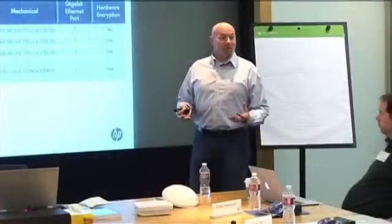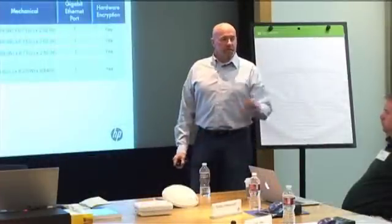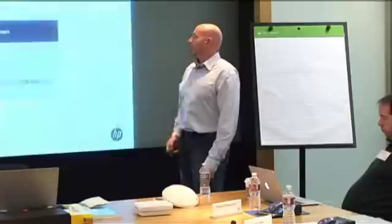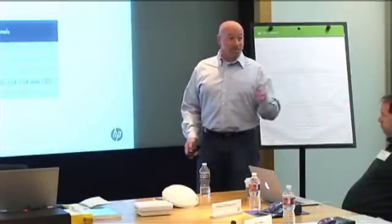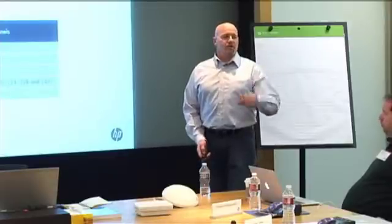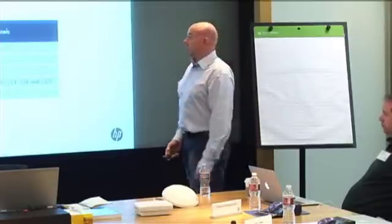Yes? Does the 466R have some kind of heater or something? I'm just noticing that when you put it below -20, it requires AT. Yes, it does, and once we get to the 466, I'll talk about that. There's actually a heater in there. In environments like where I live in Green Bay, Minnesota, when it gets very, very cold, it'll kick in. It's just a small heater, but it does require AT power to kick in that heater. But if you're in a warm environment, such as Florida, you can run it off of standard AF power. So we need that extra wattage to kick on the heater to keep it warm.